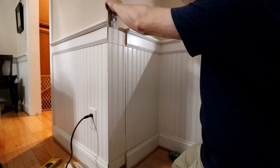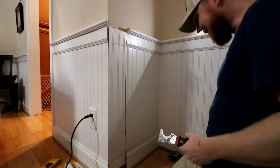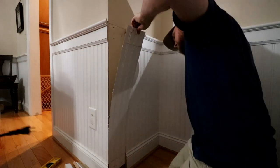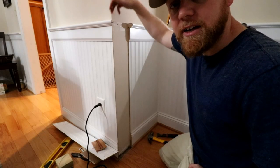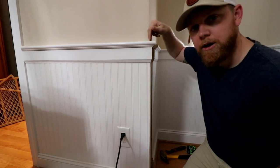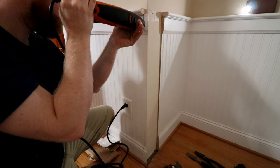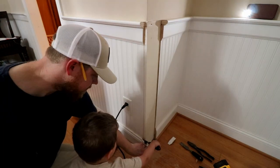Little pops didn't say a word. We didn't say a word. And the way our door casing is, it's actually going to overlap onto this wall by about a quarter of an inch. So we're going to have to come right here and draw a line similar to how we did over here, and cut all this off as well.